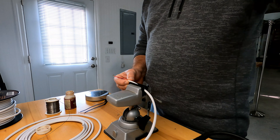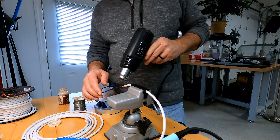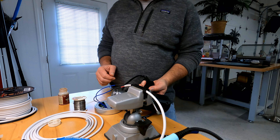This is a process I learned many years ago working for an electrical engineering company. It involves tinning the wires first. Then you take a small pair of needle-nose pliers, grab the very end of the tinned wire, and make a little loop. I've already got heat shrink to cover up those wires — slid it back over the blue wires, with another piece of heat shrink on the white wire. You hook the little loops together and solder them. When I'm done I'll show you the finished product.